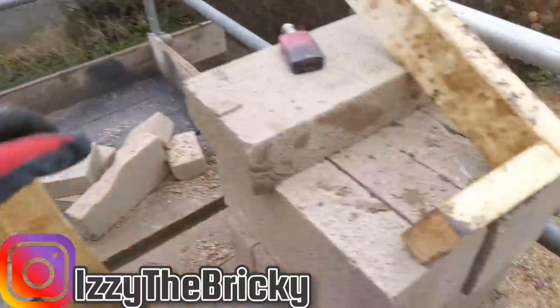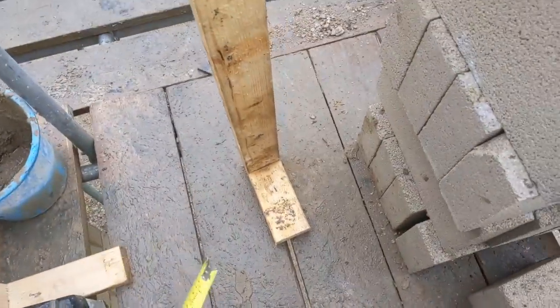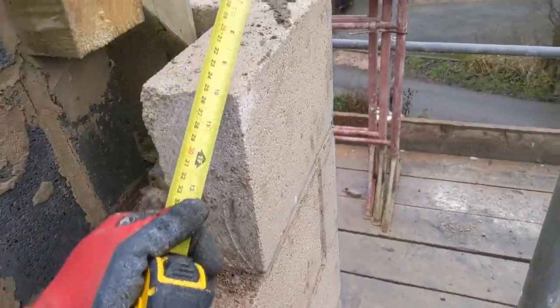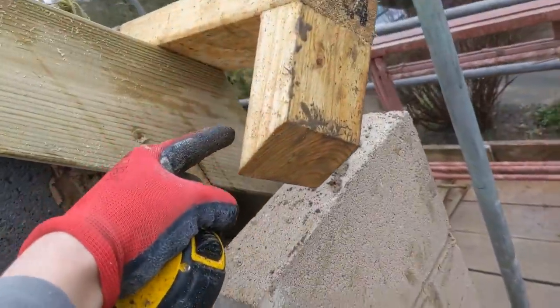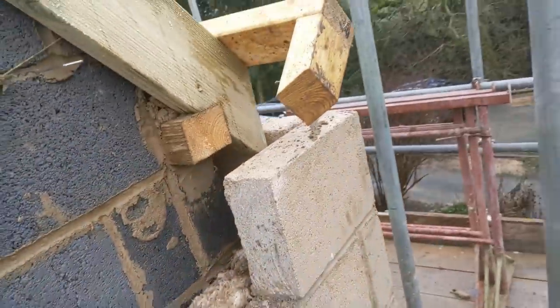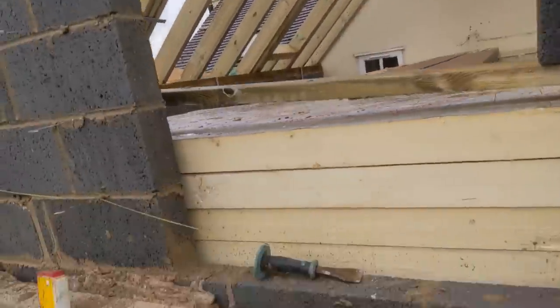If you follow me on Instagram, you would have seen me using them a couple of days ago to do a brick detail. What it is, basically, a bit of wood, what goes on your rafters. And then you've got this little down stand, I call it, with a nail set in at 75mm. So I'm going to put a line from this nail up to a hockey stick I'll put up there, and then I'll cut my block work to that. So dead easy, and then that allows me 75mm for a one course brick detail up the gable.